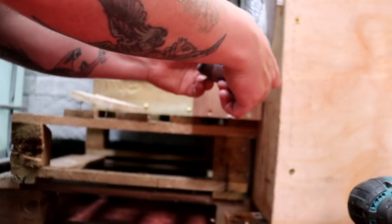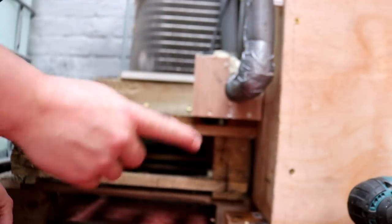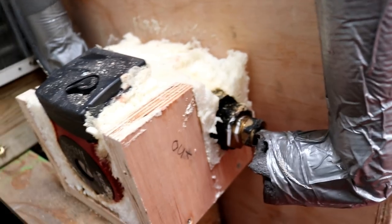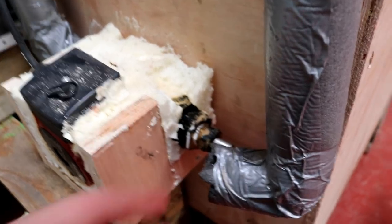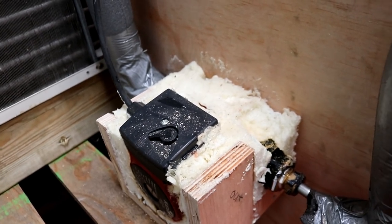Unfortunately, it's not pulled all the rest of it out. I think that what's happened is, it's overheated. It's melted the pipe, it's not been recirculating the glycol properly because it hasn't been primed properly, which could be my fault entirely. So we'll do a bit more investigation into this. We'll hook it back up, we'll see if we can get it to turn back on, or it might just be fried, I don't know.